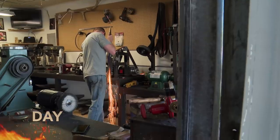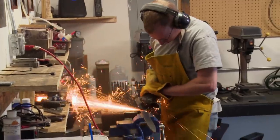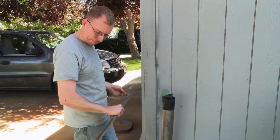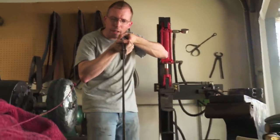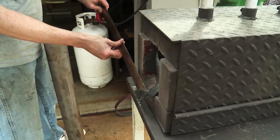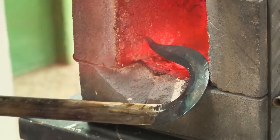I like it. So day two plan of attack's gonna be simple: get the main portion of the sword cleaned up to bare steel and then heat treat. Looks like it's coming together. I don't have a quench tank large enough to do the whole thing, so I'll do two heat treats. I'll do the main post of the sword first, and then the hook secondly. If I do it this way, the heat will just hit this part.